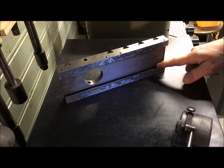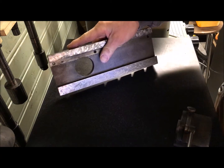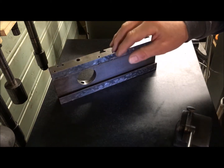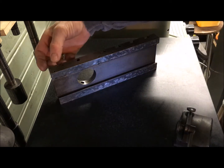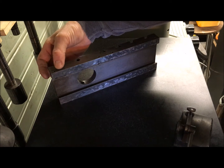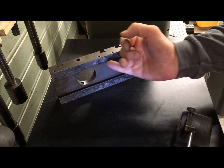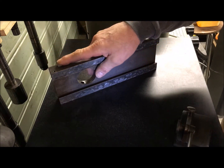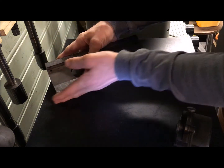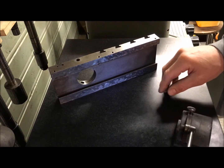This will be the reference to the underside here, and the underside I can prove is useful as a reference by measuring them against the top and also the underside. So I have three surfaces altogether that should be in the same plane, so to speak. I will then verify that they are just that.